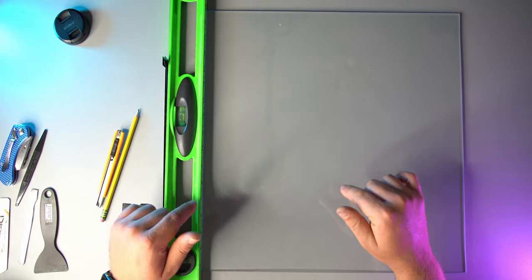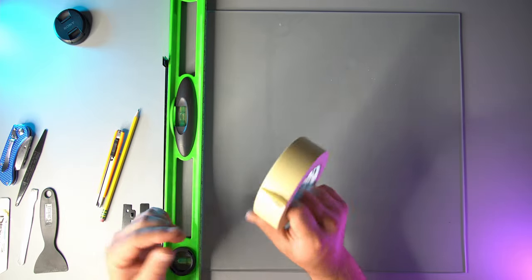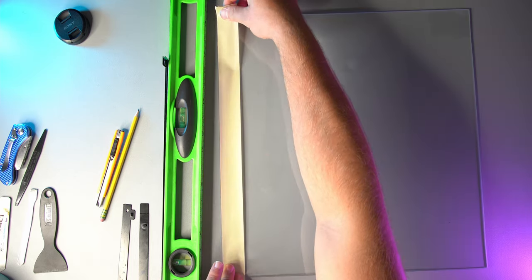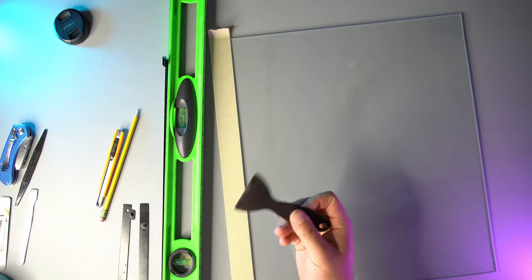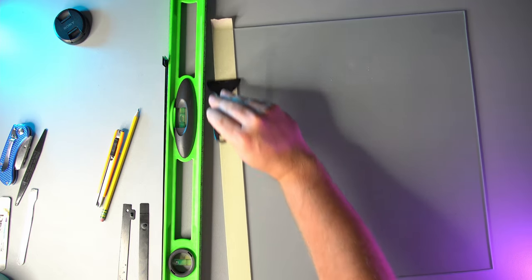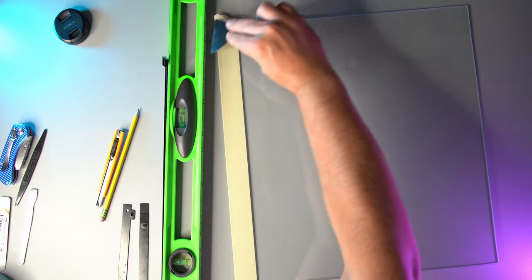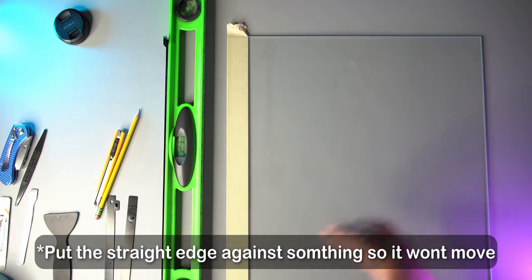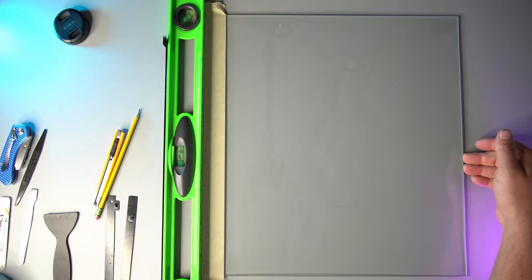So that's exactly what we're going to replicate on this one. I'm going to show you every step I took to measure this out and get the borders right. I've got just some painter's tape — general use. I'm going to put my first piece of tape down; this part does not need to be perfect. We're going to need something to completely flatten it out, so use something like a credit card — I have this plastic scraper. Just flatten this all the way down. I already cleaned this with alcohol so the tape sticks perfectly. I've got a level which is straight — I put it like that, then put the glass all the way up against it to get a straight edge.